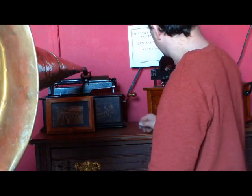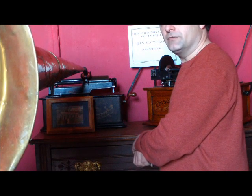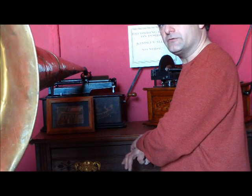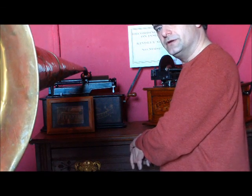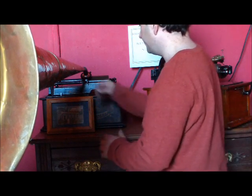This is our dubbing using the original studio recorder. It has a seven and a half thousandths of an inch glass diaphragm and a copper stylus holder. The stylus was made by a company for us around 2001. We would hope sometime to have enough interest — if you contact Chuck Richards — it would be great to have more runs of these cutting styluses, as they were the most accurate cutting stylus in modern times made. The cut point center stylus with the very sharp edges is what we use here, based on the original Edison cupped point center recorder design. Let's play the selection.